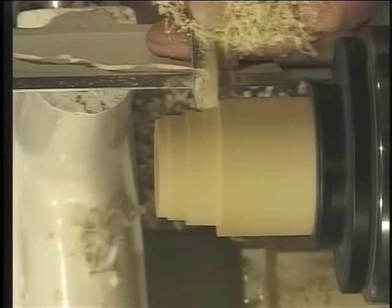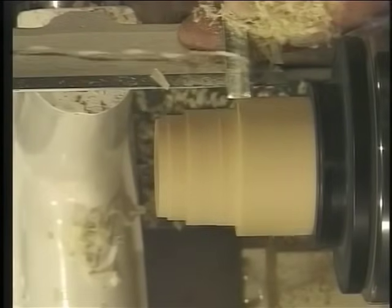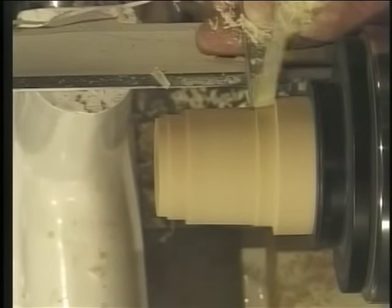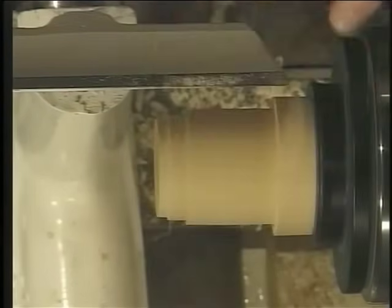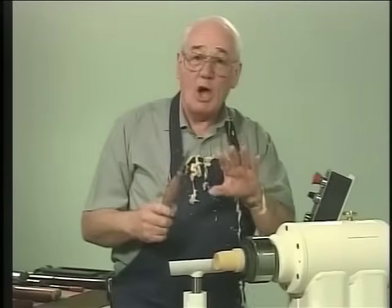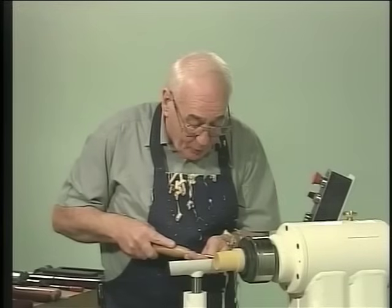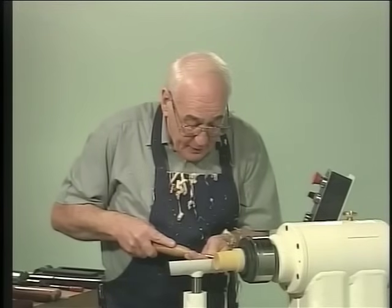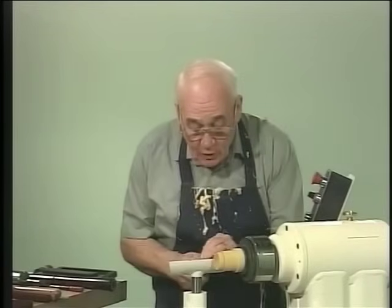Just removing some waste at this point. And if you remember, a priority we discussed earlier was to form a groove, again, to allow the tool to be removed. We do that again with the point tool at the end of the thread, there, and we just clean up our little shoulder. We round it over the leading edge,